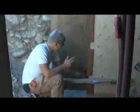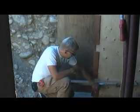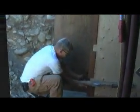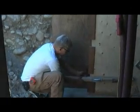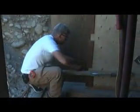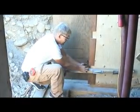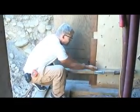If you choose to mix ties, we've got the conical tie here, which has already been tapped on like this. You have to allow room above or below any type of reinforcement you have with this to slide the whaler bars in place. If you don't do that, if you do it all on the same line, obviously you can't do it because these are not only sticking out, but you can't slide the bar in there.